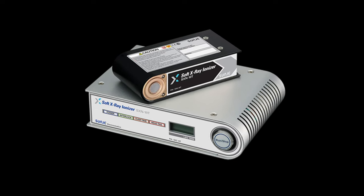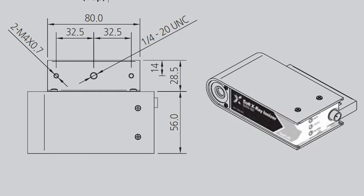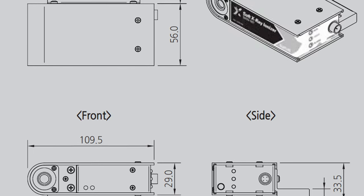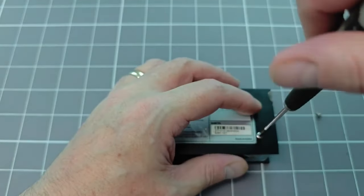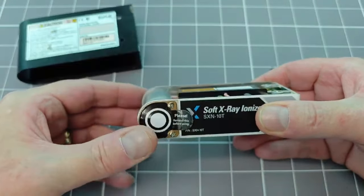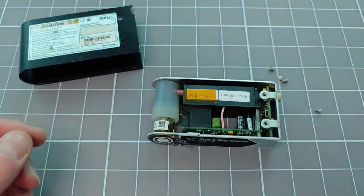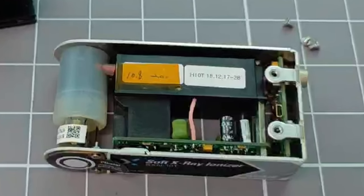It turns out that the controller unit, which is more expensive, has a safety protection system. This is to prevent the remote x-ray heads from being energized except when all the safety interlocks are in place. So I disassembled the x-ray head — I wanted to see if I could force the unit to be energized without the controller being present. This device has a very nice electronics package, a little bit too nice in fact — it defeated all my efforts at hacking it. You can see the soft x-ray tube and the 10 kV power supply; the PSU even had interlocks that prevented me from using that part.